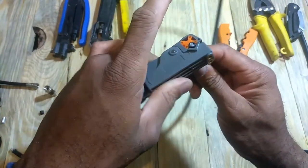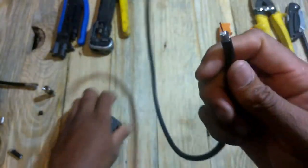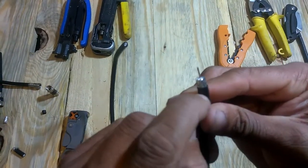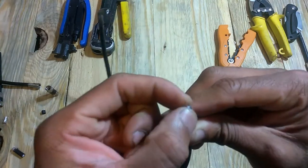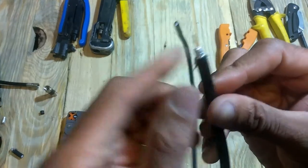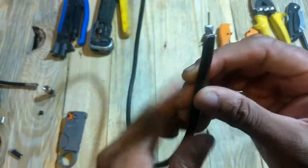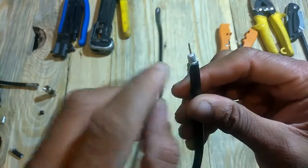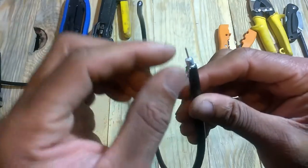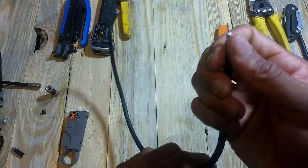When you're stripping your coax, put it in there and turn it — just look at the arrow, it says go up and over. When you're using the right stripping tool, it takes both layers off that you need: this black outer layer, and then that whole dielectric center for another half of the portion you stripped off. That way you can pull it back. One thing you must absolutely make sure is that none of this braided wire is wrapped around the center conductor, because that will completely mess your whole system up — these two are not supposed to mix or touch each other. If they do, you can get an arc or a spark.